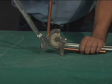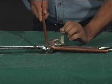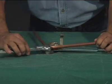Remove the bent tube by pivoting the handle to a right angle with the tube, disengaging the forming shoe, and release the tube holding clip. This is how to bend with just one of the available tools, and instructions for each method from the tool manufacturer should be followed.